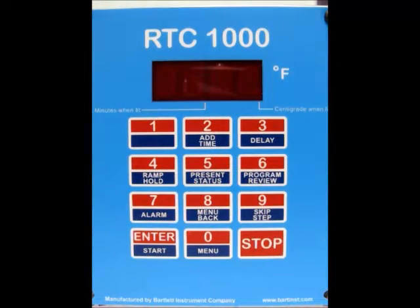Now that we've got the jumper installed, go ahead and return power to the kiln and controller, and then check the temperature reading. If we see a normal room temperature with idle — like we do right now — that means there is a problem with either the thermocouple or the thermocouple wire, and it will need to be fixed or replaced.